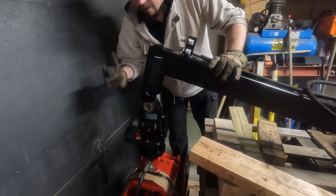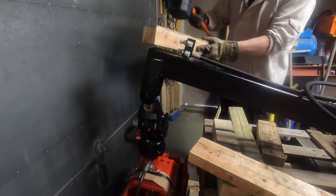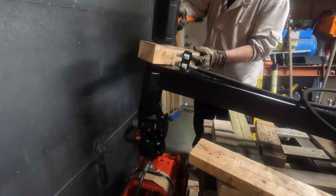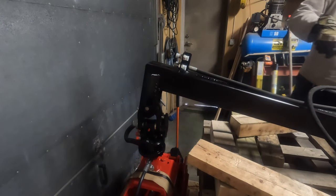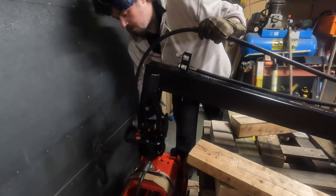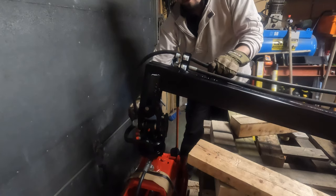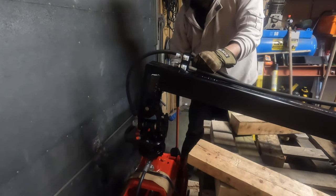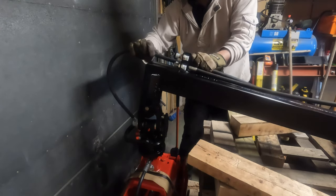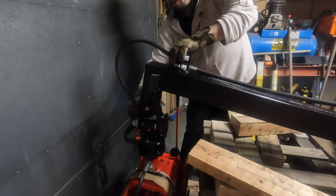It looks a little bit tight. So all four hoses goes down here on one side, on the outside, and then up here. But when the grapple swings in this way, it's going to stretch the hose. So we have to have enough length for that movement. So I don't know, maybe something like this.